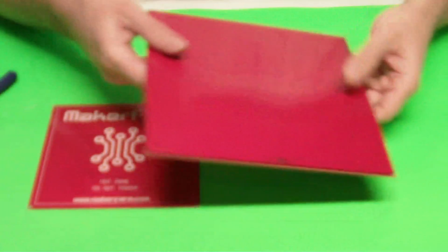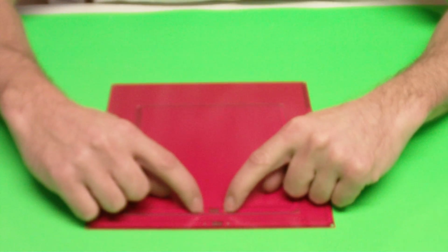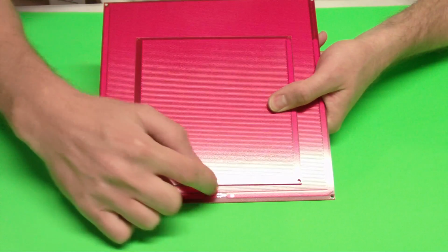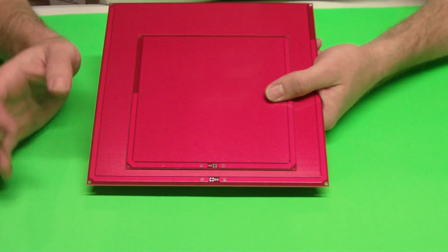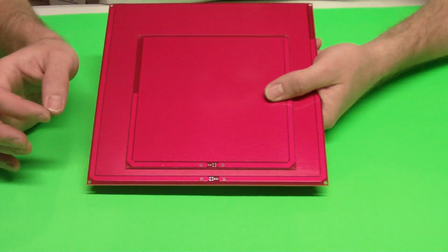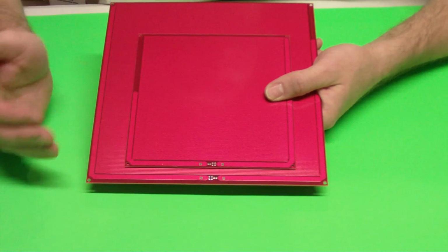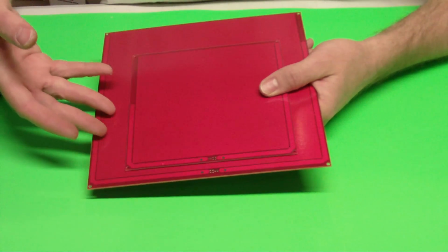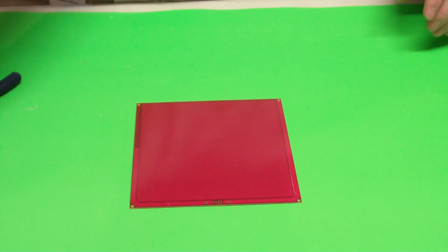Okay, so if you turn them over, on the back side of each of these, you're going to have two large pads on the outside. Those are where we're going to be soldering to. All the pads on the inside there, those are for resistors and an LED. The only thing that does is it turns that little LED light on when there's power to the board. Most of the printers these days, you can't even see underneath the bed, so we don't use those anymore. They're just kind of pointless, but they are still there if you wanted to solder on some surface mount LED and resistors.